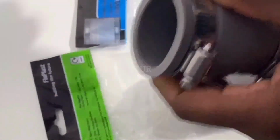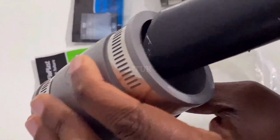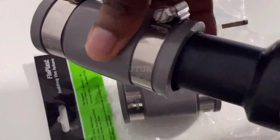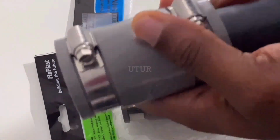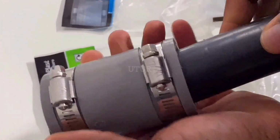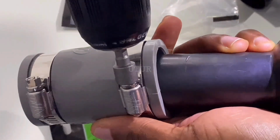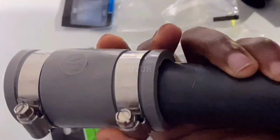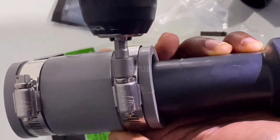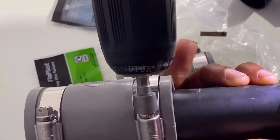On visual inspection, the vacuum adapter fits the 40 mm and 32 mm couplings. We just need to torque tighten afterwards. So here I am installing the solid non-flexible hose bit into one end of the coupling. The only risk associated with installing the non-flexible bit into one end of the coupling is that when you're moving the circular saw, it could break the vacuum adapter, and that's because the non-flexible bit of the vacuum hose is static, and so that could easily yank or break the vacuum adapter, which is moderately sturdy.